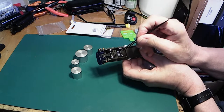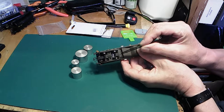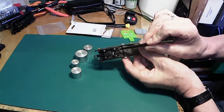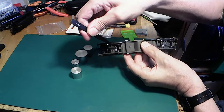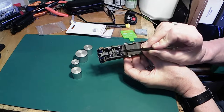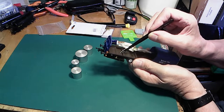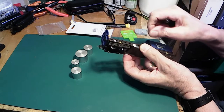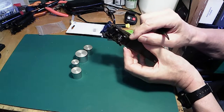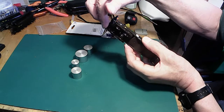So I've basically turned it back to front. So the wire is actually coming through a small hole underneath and coming through this way. So although the wiper blades are pointing there, and there's the wiper blades either side, the wire is going through that hole. And I think it was already on the thing, because it's like the pickup is there. Had to drill a hole here and drill a hole there for the wires to come through. And as I say, use thin wires because this has got to be allowed to move. You can see the wire is restricting it a bit, but there's enough movement there that it doesn't derail it.